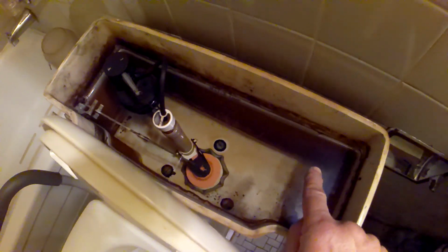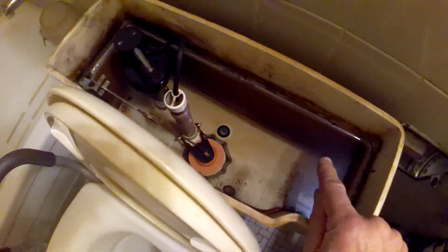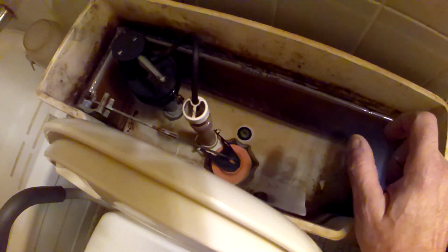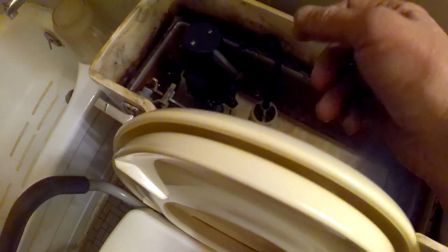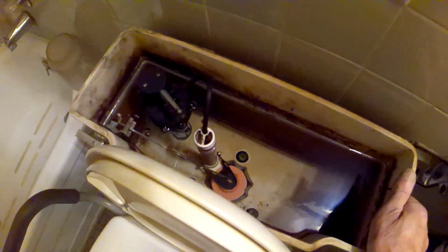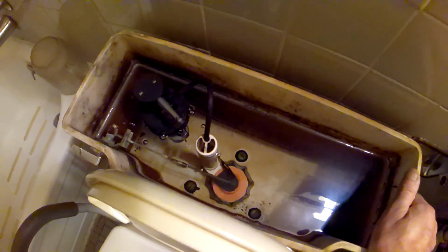And there's basically only two different types of ways of adjusting this fill level. And I'll cover what the problem is, and the two are related, but one really has nothing to do with the other. So the fill level, of course, is controlled by this fill plunger system, which is this float controlling it. And most of these either have an adjustment on a little plastic knob that you'll turn with the screwdriver, or you have to, on the base, preset it. And you'll see set points on it where you can control the water level in the basin. So that wasn't my problem.